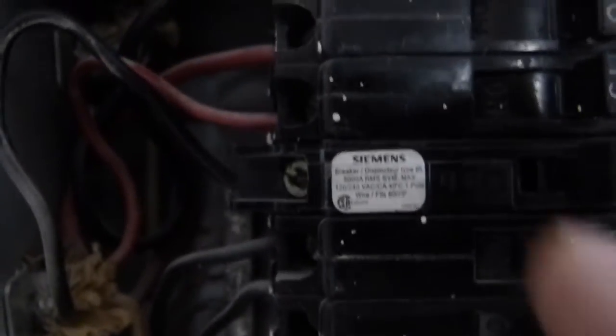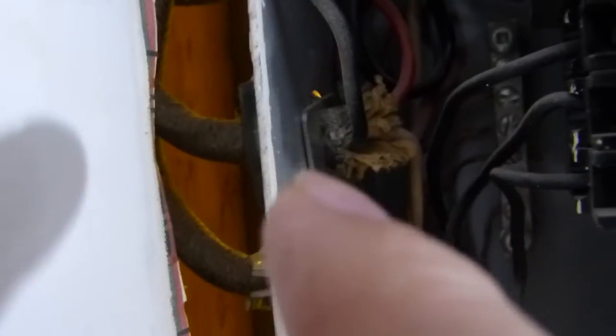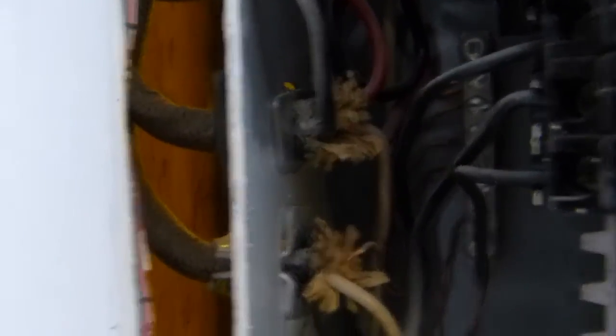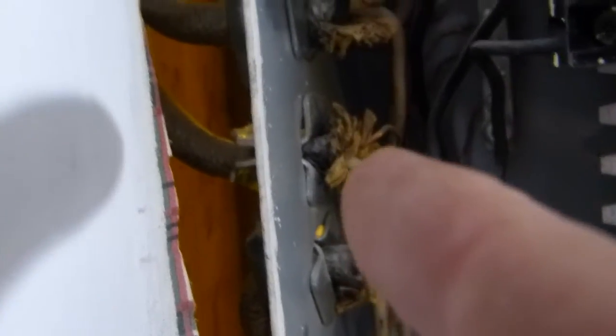You can see the same silver-colored wires on this side, and if you follow the wire exiting this breaker — the black wire there — it goes up, comes down, and goes into a wire that has silver jacketing and paper insulation. You can see it is indeed a 1971 wire. So most likely, at this breaker here, there were no changes, no alterations, no additions, no tampering done to this side of the breaker panel.